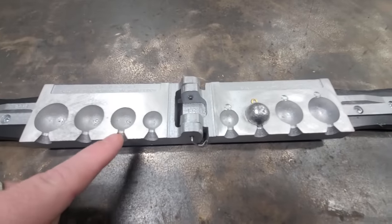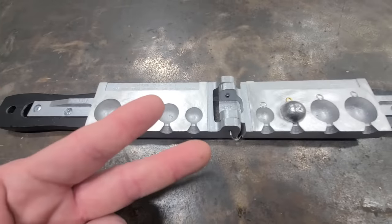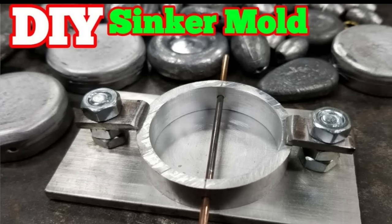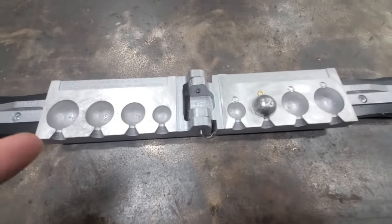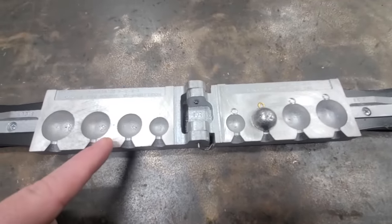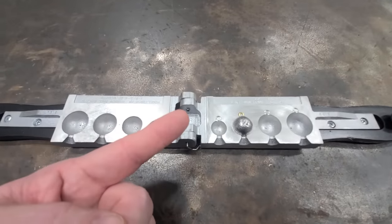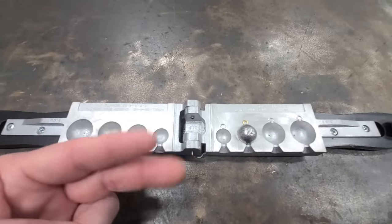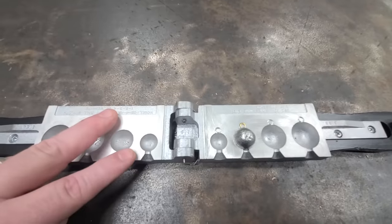Most sinker molds are made out of aluminum, and the two sinker mold DIYs I've done on my channel were made out of aluminum also. Any DIY sinker mold you make, you can make it out of wood as well, and a lot of people like to, but I like to make mine out of aluminum because one, aluminum cools down faster, two, aluminum is a lot tougher, so it's gonna last a lot longer.